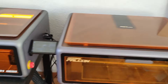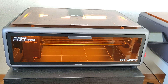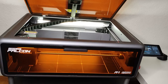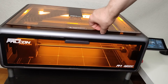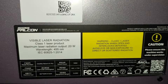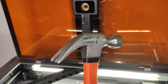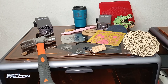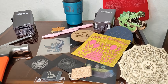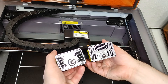This is the Creality A1 and this is the brand new Creality A1 Pro laser engraver. Let me summarize it in less than a minute before we look at it in more detail. The A1 Pro comes mostly assembled and fully enclosed to keep the smoke in and your eyes safe, and therefore also has a Class 1 laser rating. It is capable of engraving metal with a 2W IR laser module and can also engrave and cut a variety of other materials with the 20W laser module it comes with.